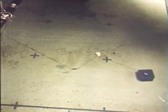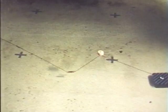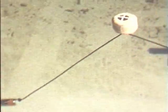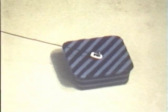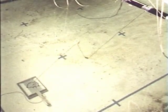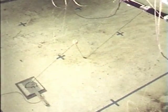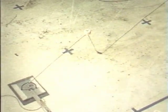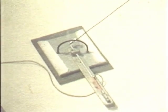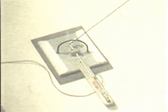That's the anchoring system there — a concrete block on the floor coming up at about 45 degrees to a float, and down again at 45 degrees to a sinker. And there's the float, and there's the clump anchor. Now we've got data on the amount of angular motion you'd need for electrical down feeders. There's a strain gauge anchor at the back where you can measure the vertical and the horizontal forces. The loop is to help us hook it out of the tank if we want to.